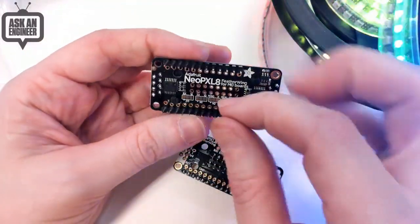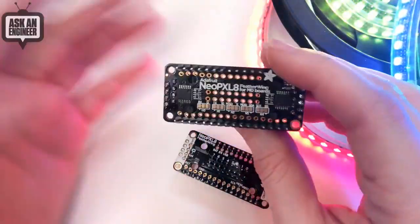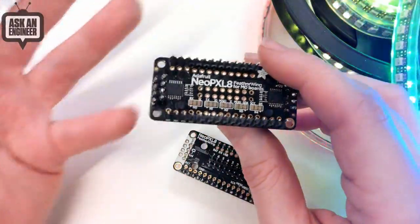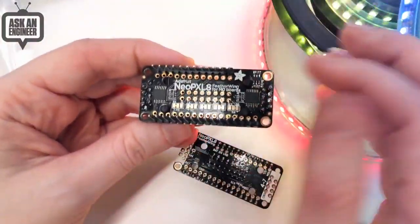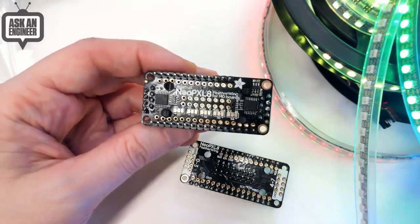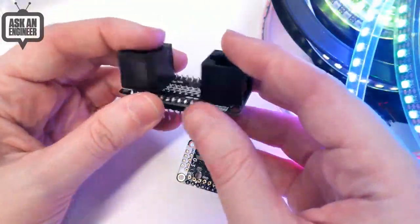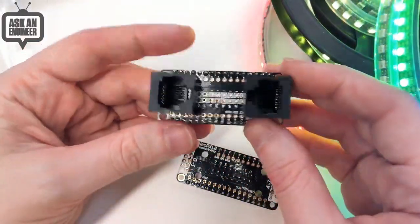Because you're using the timer output, you do have to select. Some of them have options. Like, you can use either digital pin 12, or you can use the URX pin. So you might want to cut a jumper and select which one. If you really need I2C available, you can select to use other pins instead. Basically, whatever the timer 0 output pins are, you can select them.